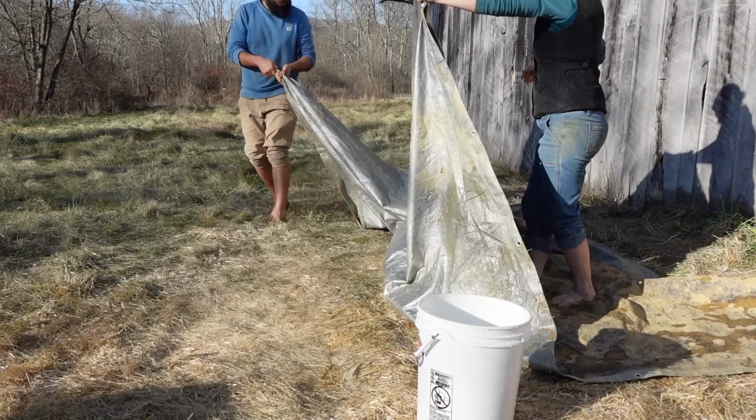So much of this work is intuitive, which is not to say that it's unskilled, but it is something that you can learn to do pretty easily by just doing it with an experienced person and then pick it up quickly and teach it to others, which I think is really cool. And it helps that for making clay plaster, the labor aspect is really fun, even when the water is freezing like it was on the day Jordan and I mixed up this batch. The best way to do it is get everything onto a big tarp and then mix it together with a sort of stomping, twisting dance, stopping every once in a while to add more fiber, and then flip the materials over on the tarp so it all gets really homogenized.